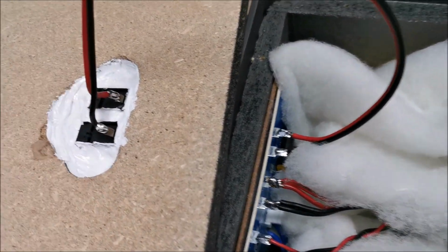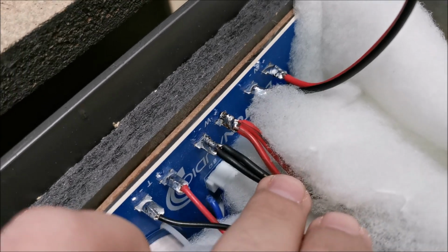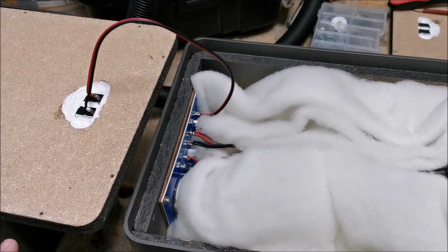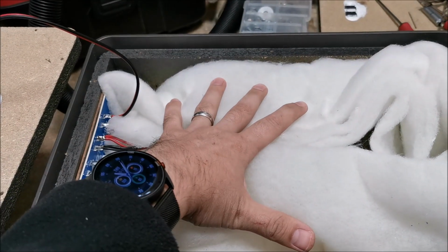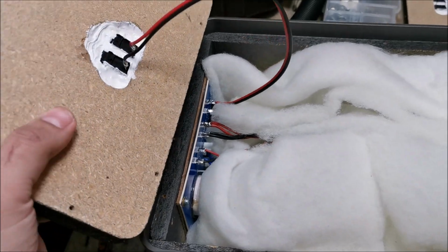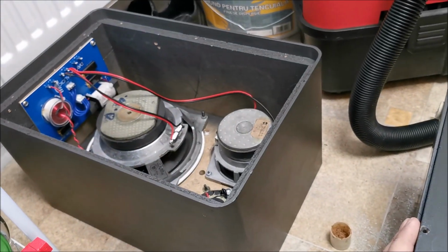I soldered the wires, making sure that red is positive and it's kept positive all the way in and out of the filter, apart from the tweeter in this particular one. Now I'm going to close it up, not finally, because I didn't put the front plates on them and they attach with screws, so I will need to take this out. But I want to see the speakers running, make sure everything is fine, and only then finish them up. So yeah, close this one up temporarily, do the same on the other.